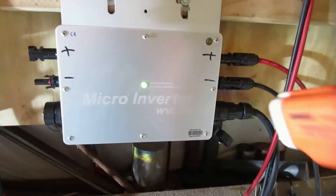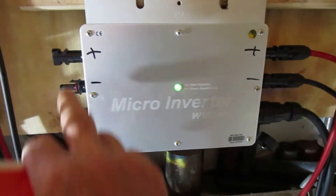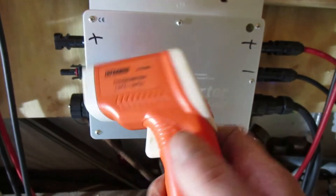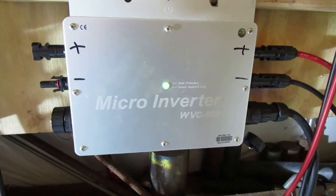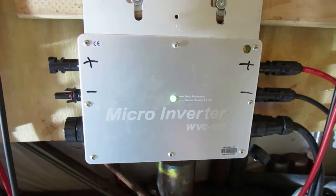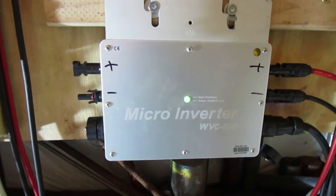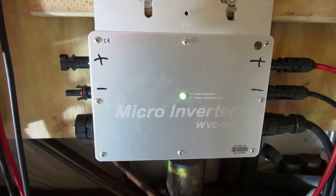The other day when I had both of them hooked up — two JNCO 305-watt solar panels hooked up to this one inverter — the temperature when I checked it with this gadget right here was 158 degrees. And no sooner than it hit that 158, this light went red. The microinverter shut down. It just got too hot.